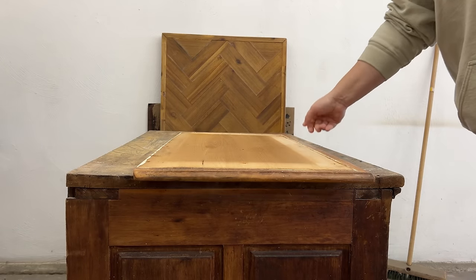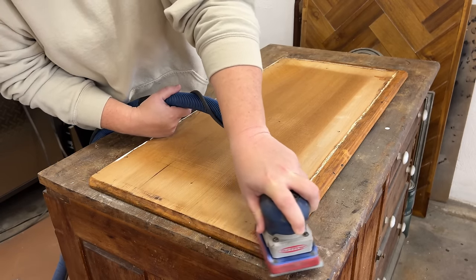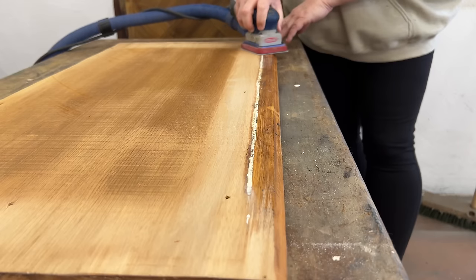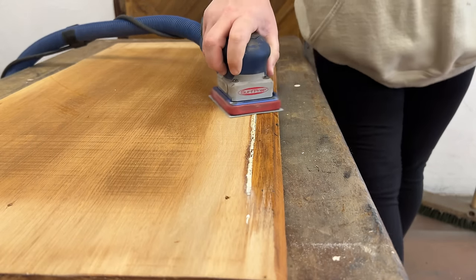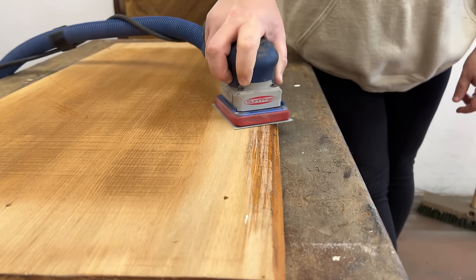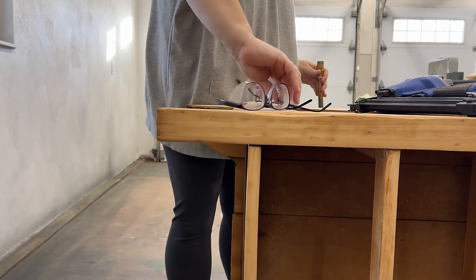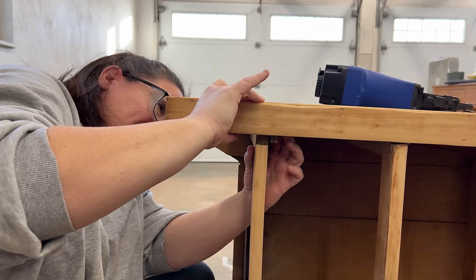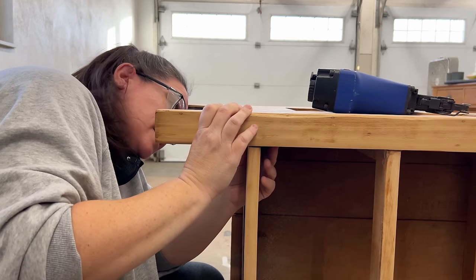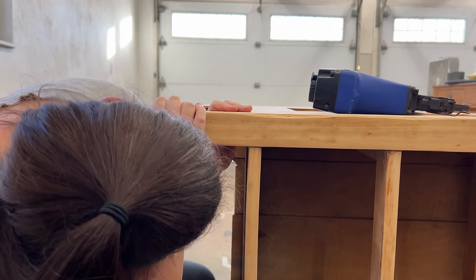I also wanted to see if some sanding would help get rid of the discoloration on the underside of this top board so that maybe I could stain it. So I used some more 80 grit to get through the rough texture and the old finish around the edges, but it just didn't clean up as nicely as I was hoping. While I was sanding, I did notice that there were some original nails and a few additional nails down the sides of the legs that were helping to hold the drawer rails in place, so I knew I could use my nailer to re-secure the loose frame pieces.